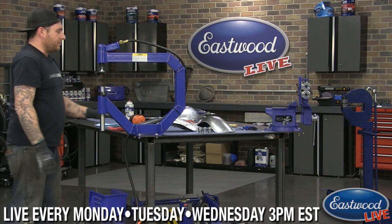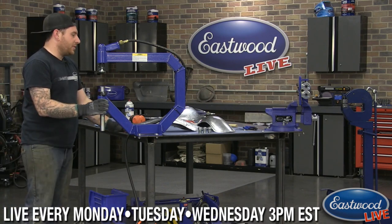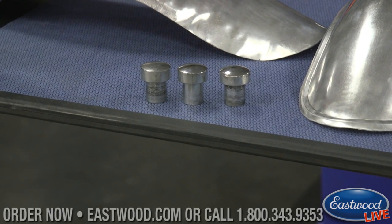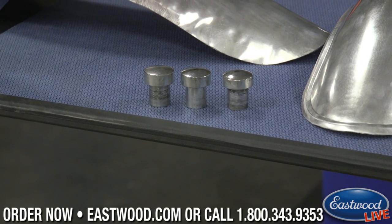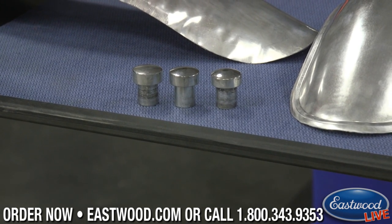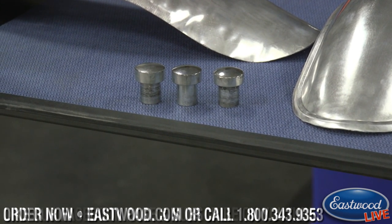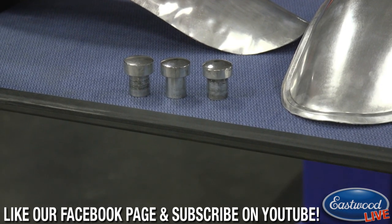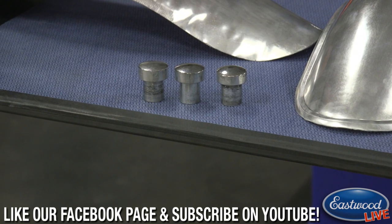So we have the three dies that come with our planishing hammer here that you can see, and they have a different crown in each one. And the biggest thing I'm trying to talk about here is they're much smaller than the width of the lower wheel and the English wheel. So it allows you to get into a smaller area. We can work a tighter area. We don't have to worry about running into the edges of the panel. So we can use that.